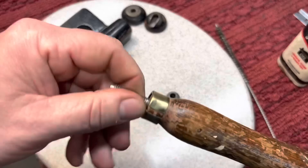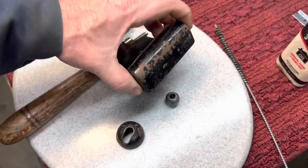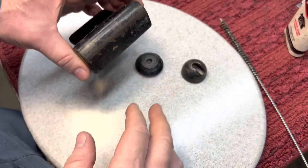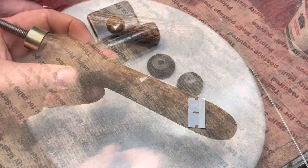This has a split ferrule, but you don't see it because it's mostly decorative and it's underneath the cap. We want to keep the original paint on here, so we're just going to wipe this down, take off any rust. We want to keep the original paint because we want to make it a nice use — we removed all the rust from the area of the chipping paint. We'll just touch that up. That's probably Japanning on there. We'll wipe it down with some mineral spirits before we hit it with a little bit of touch-up.